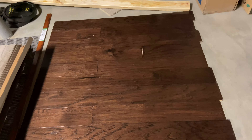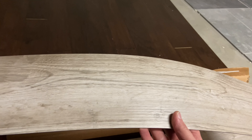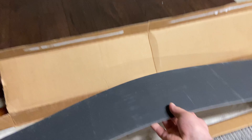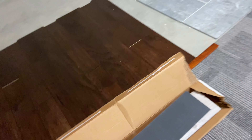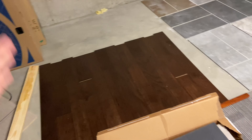There's a little bit wider gap over there, and a real wide gap there. Rather than grouting, I thought it was a good idea to just use these as that gapping system as we were going to do. Originally I was going to put down this wood floor, but that's also kind of turning out to be a pain and I don't have a lot of it, so I'm not going to use that anymore. I'm going to use this vinyl type flooring that I got from the office as well — essentially the same thing, just seeing how well it does on a hard pickup. This doesn't have any sticky back, so I'm just going to squirt a little bit of Gorilla Glue spray like I did underneath here, and it's going to be plenty enough to hold it down without getting the entire floor sticky.